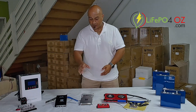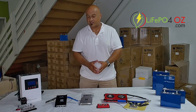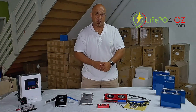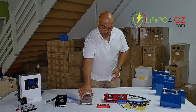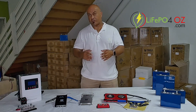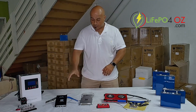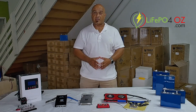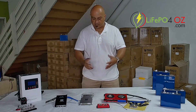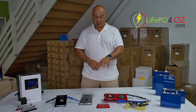The things I don't really like about the JKs: they're not really set up ready to go, and you still need to attach the B and P minus cables — they're not even attached on the 8S model. Also, as you can sort of see with the 8S model, there's only a protective plate over the top and bottom of the BMS. It's good for airflow but in situations where there may be dust and moisture it's not well protected. The 24S is in a contained casing so there's less chance moisture or dust will get in, but for the 8S model stuff can get in and it can get damaged.